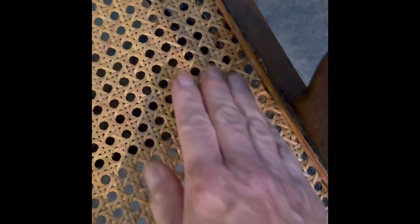First though, I have to get the old seat out, and that involves heating up white distilled vinegar and then using a brush and laying in the vinegar. I heat the vinegar and lay it into the groove to dissolve the glue. And it's a long process. And then there's this little tool. It's an awl type of a tool, and it goes in underneath the spline. And once the glue is dissolved, I'm able to lift the spline out. You'll be getting to see this as I proceed.